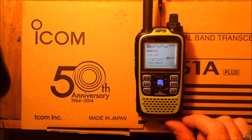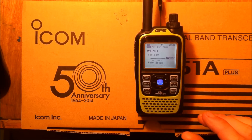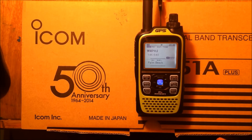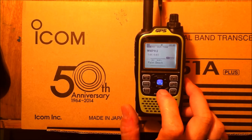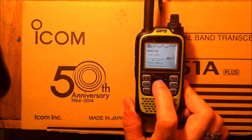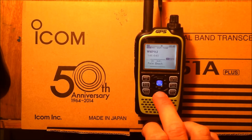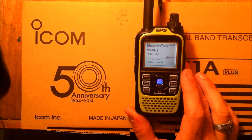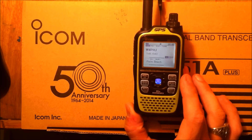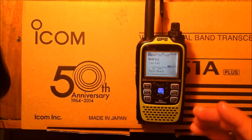There's no DTMF keypad in the front, but you can program DTMF speed dial memories in the memory banks and recall them at any time should you need them for EchoLink or other bands. There's a four-way keypad here, mostly for D-Star, plus a button in the middle. A lot of D-Star functions on here — you have a digital repeater call sign and receive call sign, so you can see who was the last person to call you. D-Star is so advanced now, it's worked the bugs out, it's very robust, and that's a whole other video.